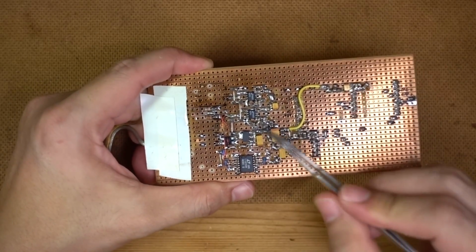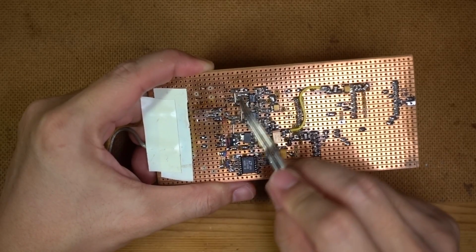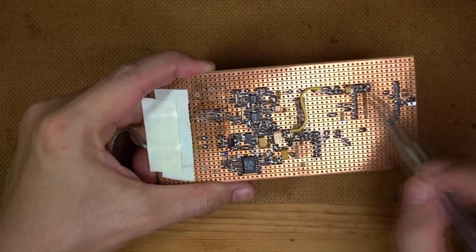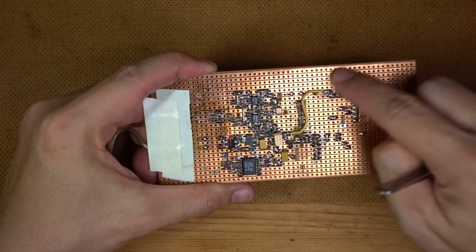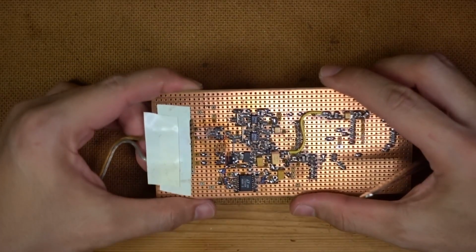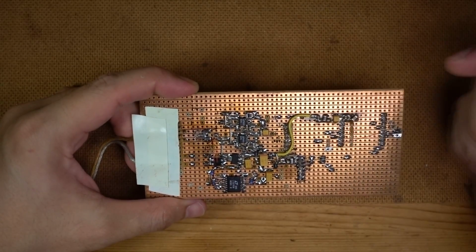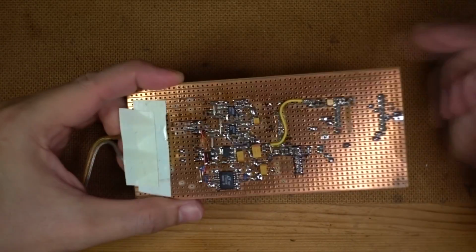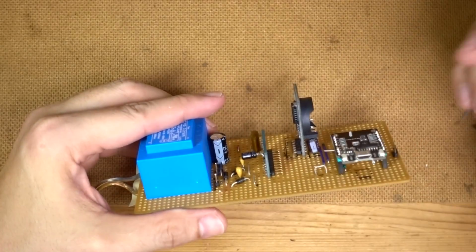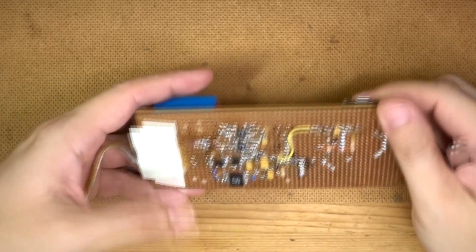On top of that, I've also added some inductors on the power line to the op amps, just to get rid of the noise, and others elsewhere. So quite a bit of things. I reconfigured the bus a little bit. Very difficult to isolate noise. I was able to reduce it to some extent, but there's still a noise problem, spikes stemming from this ADC. The sampling action of the converter creates a lot of noise.